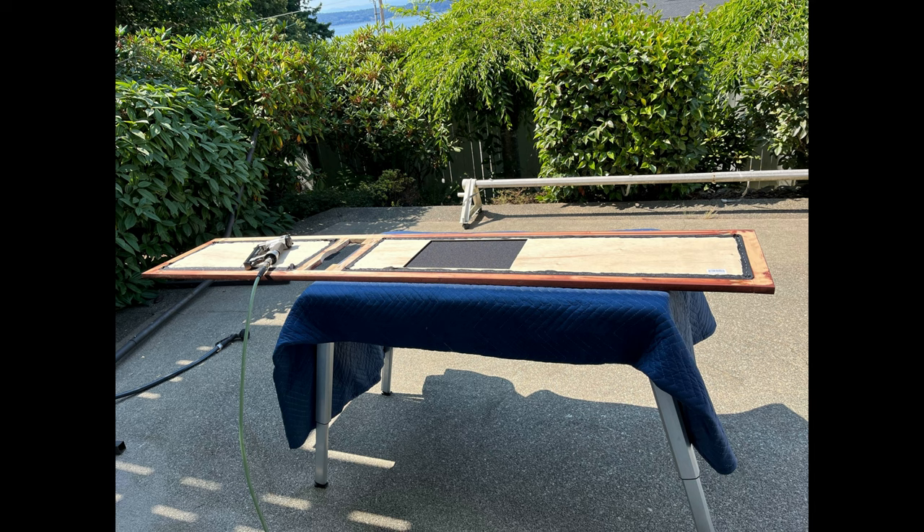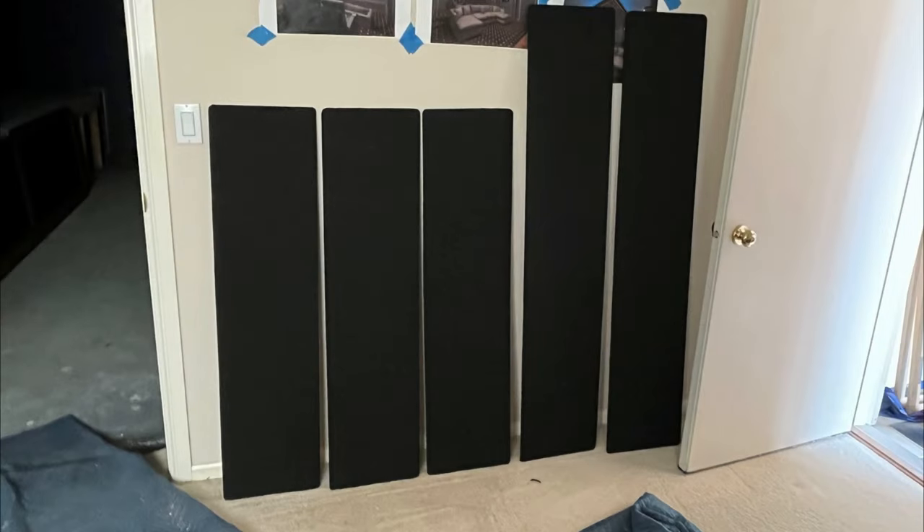The columns on this theater were built out of three-quarter inch poplar. They were then milled and we used Kreg pocket tools to screw them together — of course glue was involved. We then stained them, let them sit for two days, and continued to test-fit them and wrap individual panel inserts. After routing a quarter-inch by three-eighths-inch rabbet into the wood, we then wrap the panels.